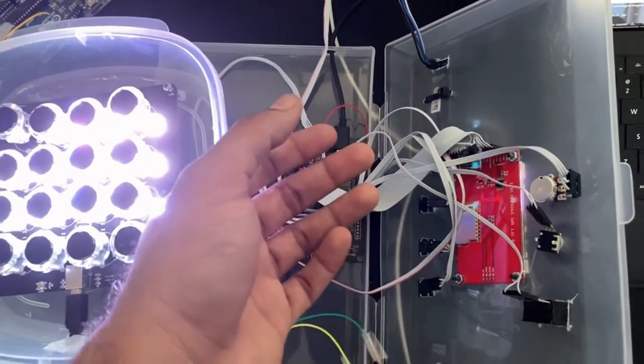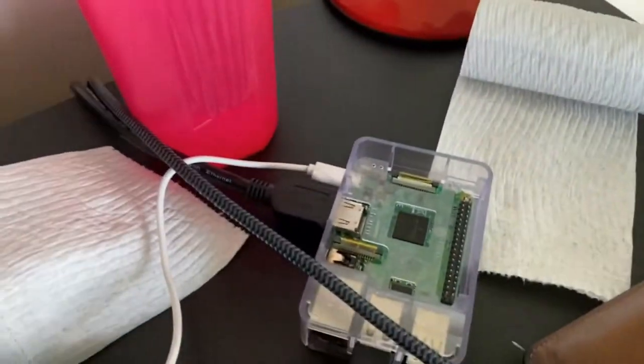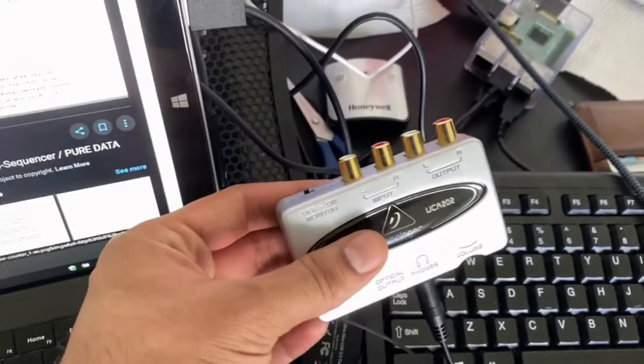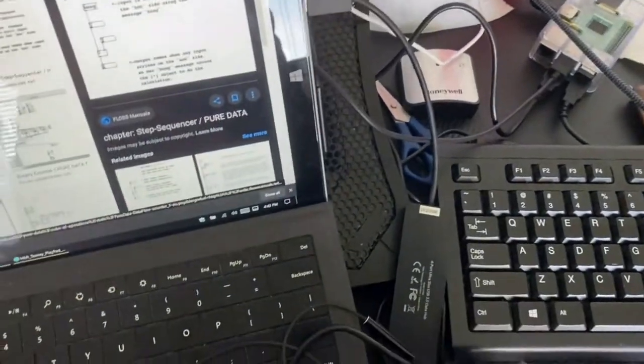through serial over USB. It's gonna send which button was pressed from this cable all the way up to the Raspberry Pi. The Pi is connected to some power, which is the white cable, a keyboard and a mouse over here, and then to the screen over there, and obviously the connection to our TNC, and eventually it goes to here, final output, which is the sound card, and that goes to the speaker over here.